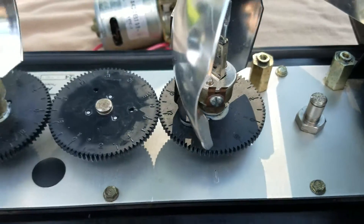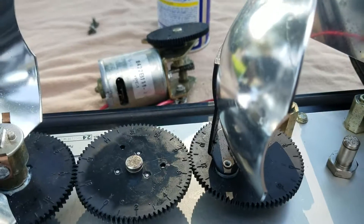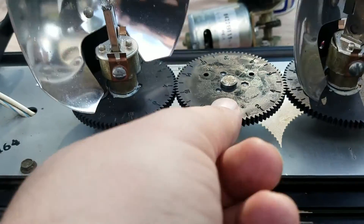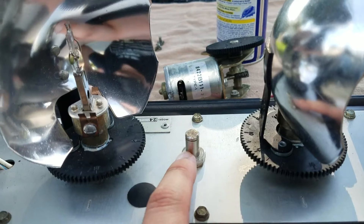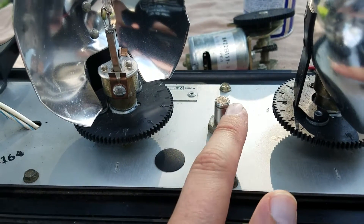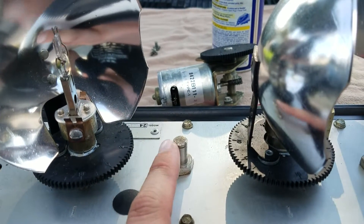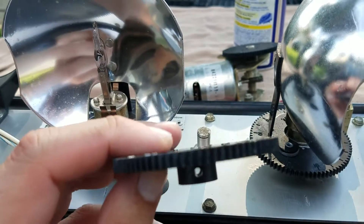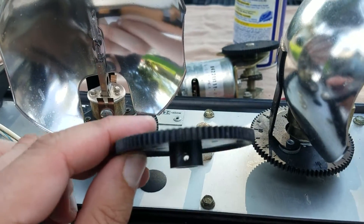Setting your timing in a nutshell: take the motor off so the clutch gear isn't making contact, then pop the c-clips off and pop the idler gears off, and have at it. Also worth noting while you have the idler gears off: apply grease when putting them back together — you don't want them going back in dry. You don't need to go crazy, just a decent layer — like what you'd use on an M1 Garand. A little grease goes a long way. Also grease the rotators themselves — there's a hole on the base of each rotator where you can put grease in.